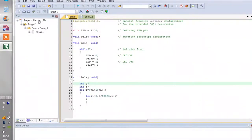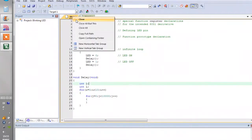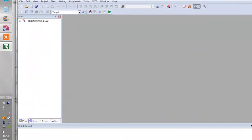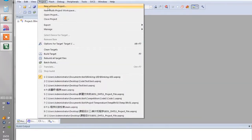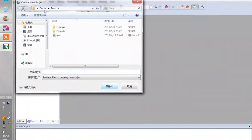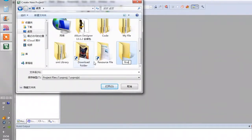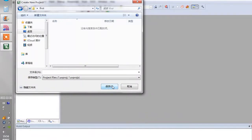First of all, you must have Keil uVision software. This software is used for writing, compiling, and even generating a hex file which you use to upload into the microcontroller — the microcontroller uses the hex file to run the entire process. Now we are going to open Keil uVision. I'm going to close all existing projects so I can make a new project for you. You go to Project and then click on New uVision Project. It will ask you where to save the project — I'll put it on the desktop in a new folder. Let's call it 'first'. Everything is in Chinese but I'll try to translate it into English as possible. I click Save and put the name as 'first' as well, then click Save.